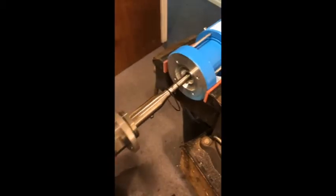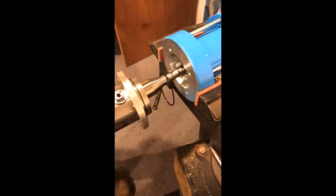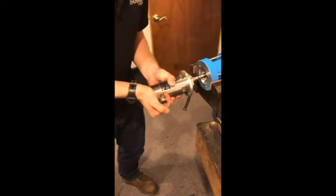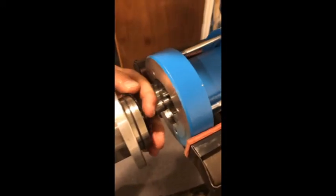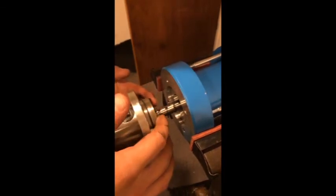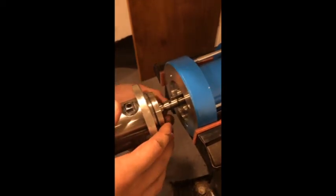We've got that on there and now we're going to go in reverse. We have our seal — remember that. While putting these back on the piston, you've got to hold on to the packings you just put in so they don't pop out on you. Get these started. Set the gasket in place — if any gaskets look dry, feel free to oil them; grease works well. If the gasket seems stretched out, you can absolutely replace it as well.